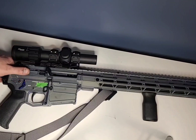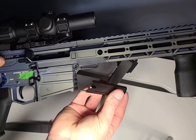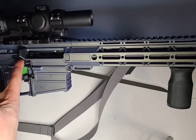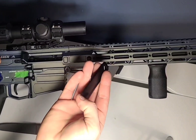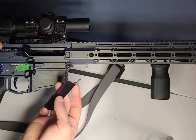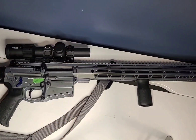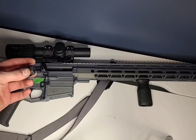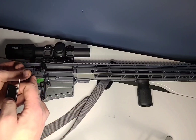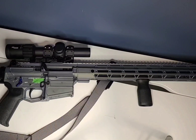Now I have you in for a closer view. I'm going to explain how this dust cover and Brass Deflector work together. The dust cover actually clips into the bottom of this Brass Deflector via this rod, and this ball detent just rubs on the side of the Brass Deflector — that's how it holds it closed, just friction with that ball detent. That's why you can't really use the plastic one, because over time it will flatten out the plastic and then your dust cover will just constantly stay open, so what's really the point of the dust cover.